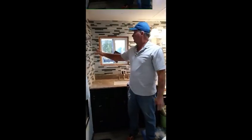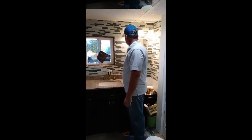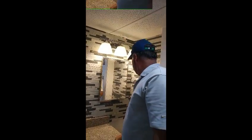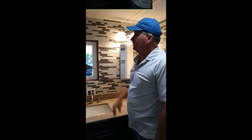Long day, but we've got it up to the point where we've got to put grout in and put trim on the windows, which can be upgraded in the future. We put the medicine cabinet back in, and the light I'll have to take back down. We added lights both here and over the shower. By feeding it over, we actually had to open up the ceiling right there, then put a piece of wood up and put it back. I'll have to seal that up and make it look a little better. We had to feed a wire over here and then over there. All that's LED — I'm a big believer in LED.